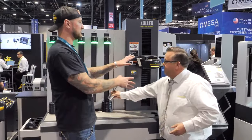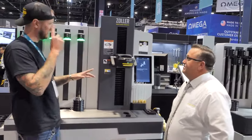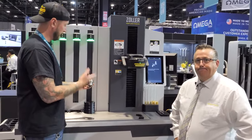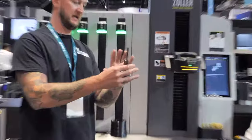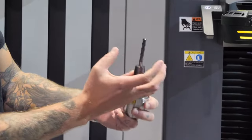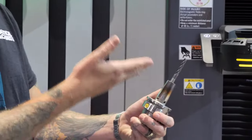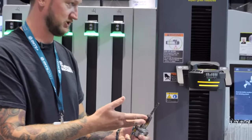For people who don't know, this is actually an induction coil style heater — that's how these things work. And for those who also don't know, heat shrinking is where you take a heat shrink tool holder just like this, you heat it up, that actually expands it out, you put the tool in, and when it contracts as it cools, you get a very solid, very rigid tool connection.